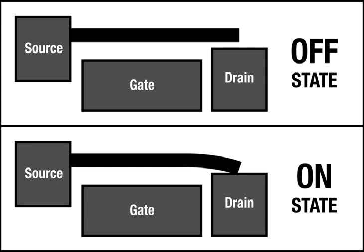In the off position, the source and drain are separated by an air gap. This physical separation allows NEM relays to have zero current leakage, and very sharp on-off transitions. The nonlinear nature of the electric field, and adhesion between the beam and drain cause the device to pull out and lose connection at a lower voltage than the voltage at which it pulls in.